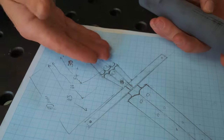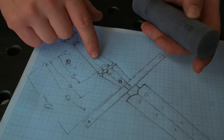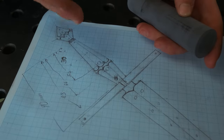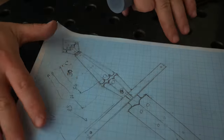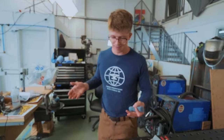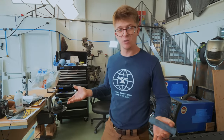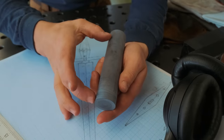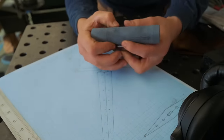Now this is going to go to the milling machine. If you have a look at my acceptable drawing here, you'll see that we have some holes. Something I want to do is have these holes go the whole way through so you can see the tang on the inside - part of the theme is it's going to be very holey. Life is about doing little bits and bobs that you think are a little cooler. This needs a number of different size holes, and before we turn down the tapers I'm going to put them in with V blocks so it's all parallel and easy.